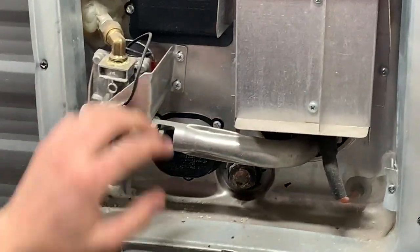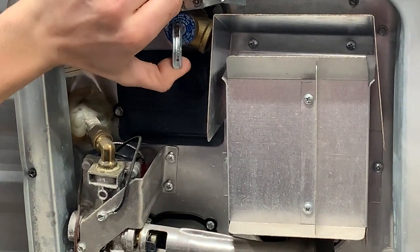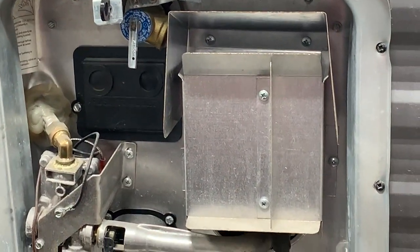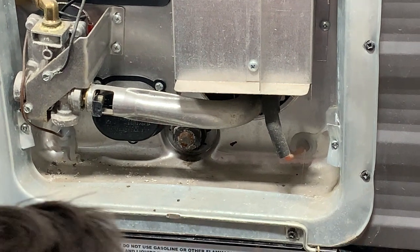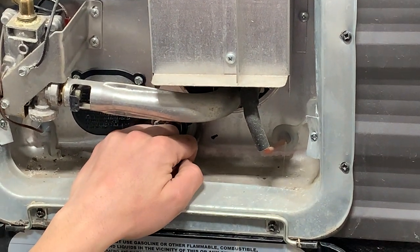The only thing you're going to have to worry about back here is just this pressure relief valve. Whenever you first get to your campsite, you just want to give that a pull. There should be a shot of water that comes out of there. Because there's no water that came out of there, that's just telling you that the tank's empty. This unit's currently winterized, so it wouldn't be safe to fire up that water tank because you run the risk of burning out your probes.